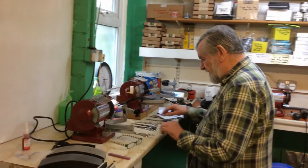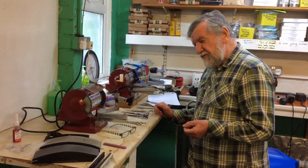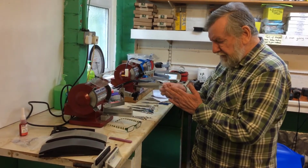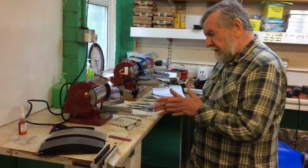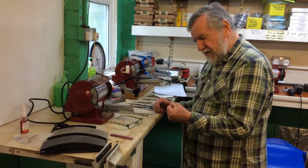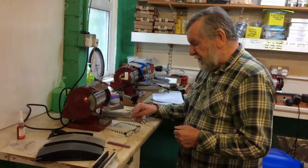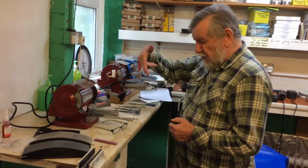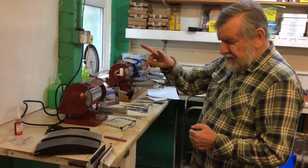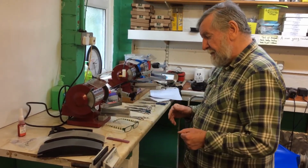Here are scissors, plenty of scissors here, which I have taken apart. In some cases you may have to take them apart because there's foreign bodies at the pivot point. But the whole message is, the hairdresser gives me a scissor, Arthur, can you give that back to me so it cuts from the pivot point right to the tip for point cutting, for chipping in, for slide cutting, or as barbers call it, for feather cutting.